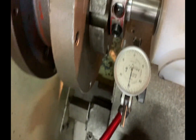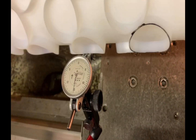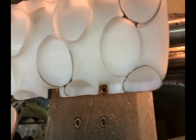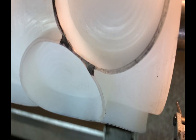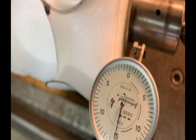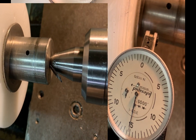Once you indicate the shaft to zero, you set your DRO — the digital readout — to zero. Then you want to touch up on the horizontal side of the shaft, not the top of it when you indicate it, but on the side. Zero it, then walk the carriage all the way back to the tailstock and do the same thing at the exact same dimension as the headstock — that's why we zero our DRO. Now you see me touching it at exactly the same spot at the same OD dimension.